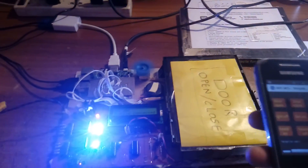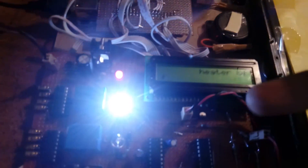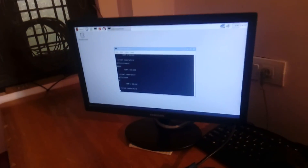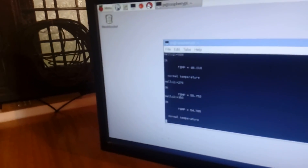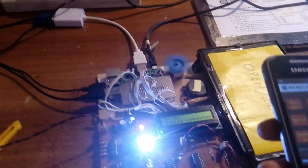Now I am going to increase the temperature by applying a heat source to the sensor. You can observe the temperature rising: 42, 48, 55, 61 — at which point heater off is triggered, and the alarm and light activate. It will also display 'over temperature' on the LCD.